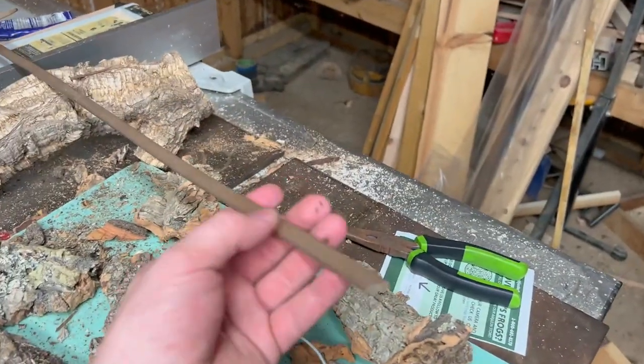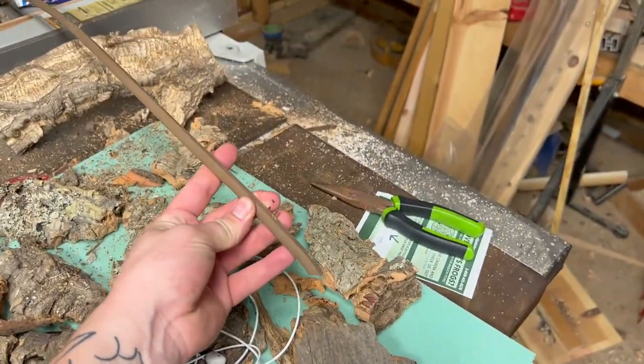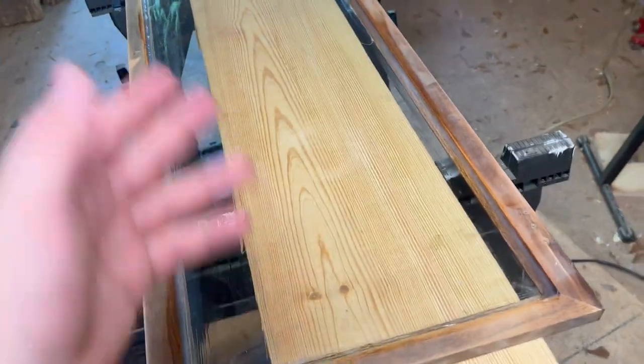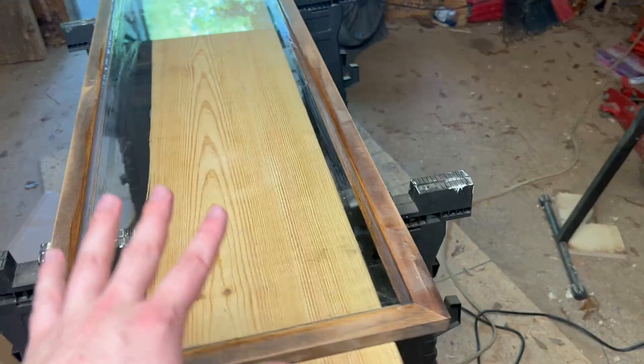Update time. I am all sweaty and I've gotten a bunch of stuff done. The glass panel for the door was held in by really cheap liner stuff with staples. So I pulled that out and I laid down a small bead of silicone around the outside, laid the glass in, and then laid another bead around and smoothed it down. I'm probably gonna have to trim it with a razor blade later, but that's curing now.